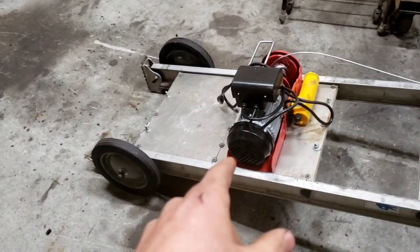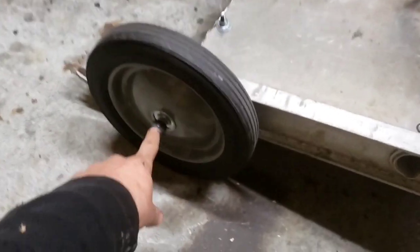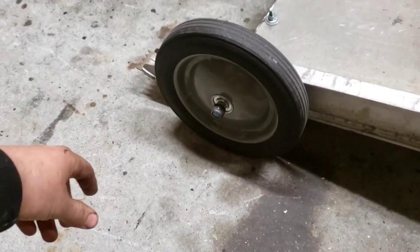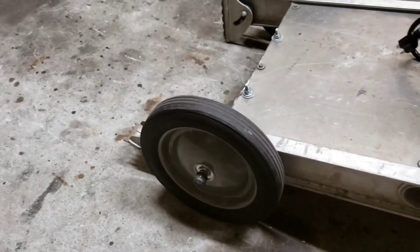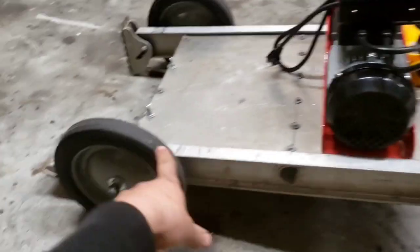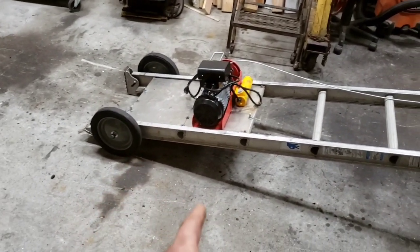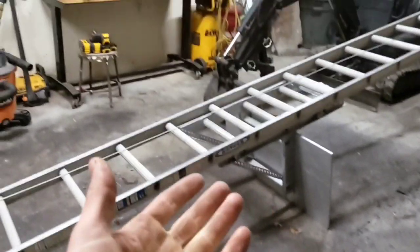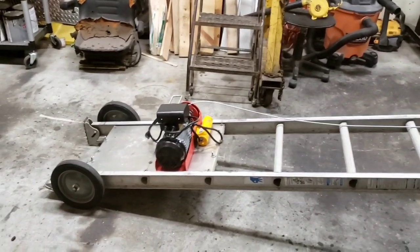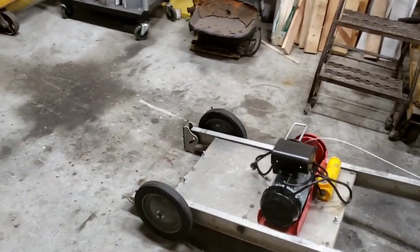Next up we have the motor mount plate and the wheels — starting with the wheels since that's simplest. This is just a threaded rod with nylon stop nuts and some wheels I had lying around. That threaded rod just gets stuck through the actual rung of the ladder — you can put those wheels wherever you want, but this works well because it sits on that platform and you can cart it around. I'd recommend putting the wheels on because this thing gets kind of heavy and awkward, especially for one person.